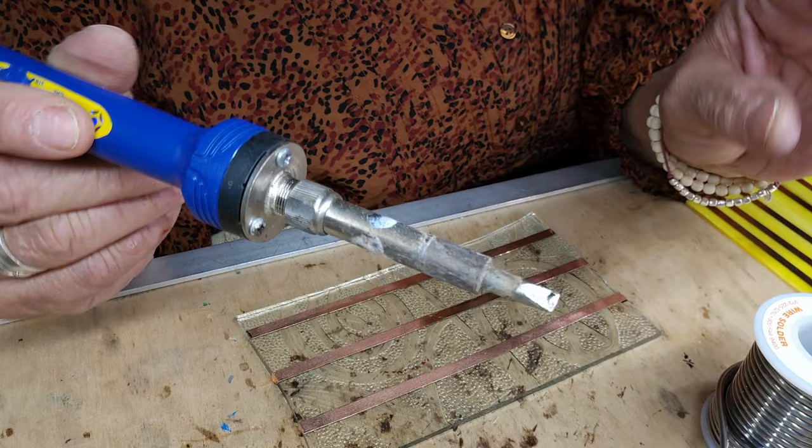So I'm going to go all the way to the end. I take my flux Q-tip and I can go over it again — I'm going to do it one more time. Just one more time. Don't need to do it three, four, five, six times. And if you do, what will end up happening? You'll break your glass. Don't hang out long in one spot, just go over it. No paint brushing. Paint brushing is bad.